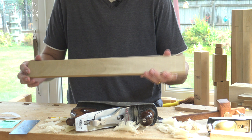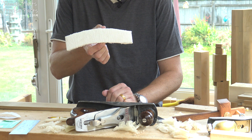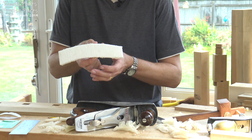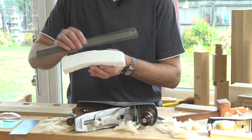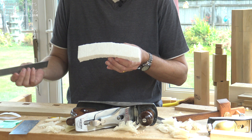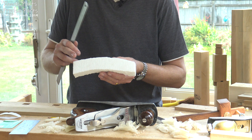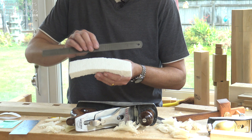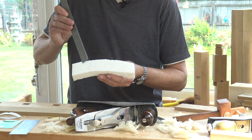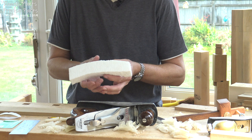In the worst case you could end up with something that's bowed quite a lot, and that brings into question how we actually sort that out. If we've cut reasonably close to our finished thickness, removing all of that curve from the top and bottom means we may end up with a board that's not thick enough. The joinery on the ends is unlikely to be quite as thick as the rest of the component, so when flattening this curve we may only need to flatten as far as the tenon shoulders at each end. That difference may actually make the difference between having the right thickness at the end of the day or having to throw that piece away and cut another.